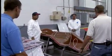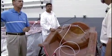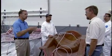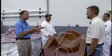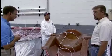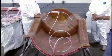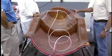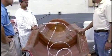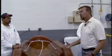Another system we use here is called RTM — resin transfer molding. When we were talking about the 310 head door earlier, I made reference to that part being a great candidate for this process, because it's finished both sides and requires the tolerances for a part like that. This here is a 240 head door — same thing. Basically, resin is injected and pulled through the part through the dry fibers, similar to the other techniques. Once it fills, we know resin is coming out the exit hole and we know we've filled our part.